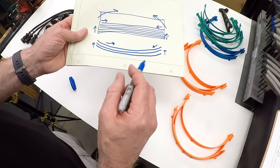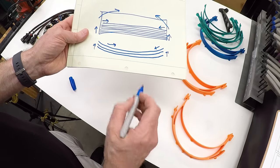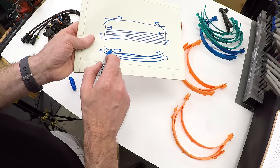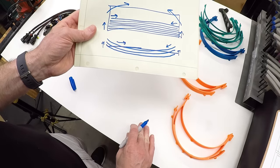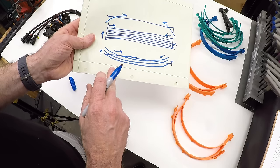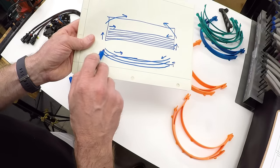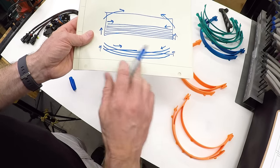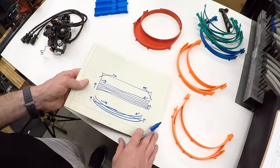This causes all kinds of problems when printing. If I've laid down three layers and try to lay the next one, the printer will try to lay it level but will collide with the sides of the print that have already raised up. It may push it down and squish the plastic, but can't control the dimensions that way because of the pressure. Or it may actually collide with these edges and knock the part clean off the bed — and you very rapidly end up with a whole plate of spaghetti, which is usually not what you're looking for.